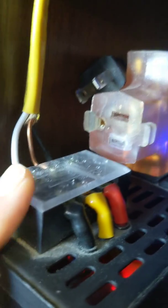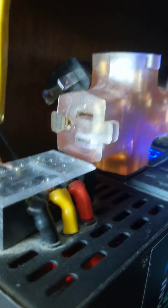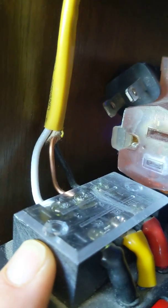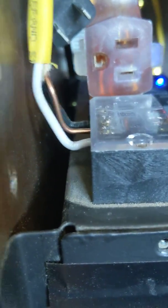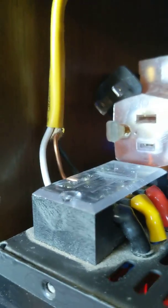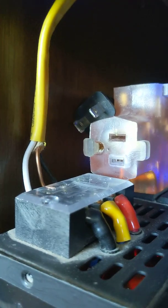This is where you're going to be hooking your breaker box and all your circuits and whatnot. This is the same voltage coming out of here as those numbers, and so you can straight up take your Romex and hook it to these three and go to whatever your system is and whatever you've designed it for. If you're going to have a bunch of circuits and different plugins and a whole ton of switches, you're obviously going to have a breaker box and whatnot.